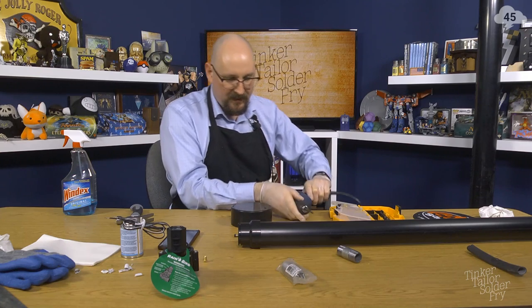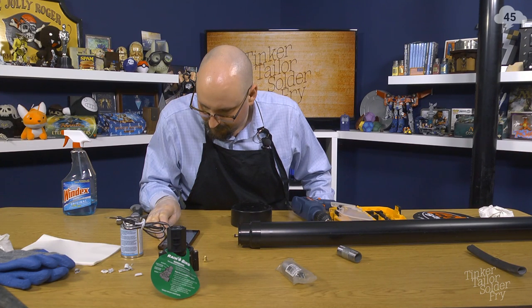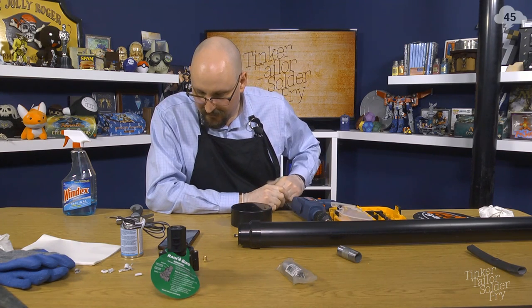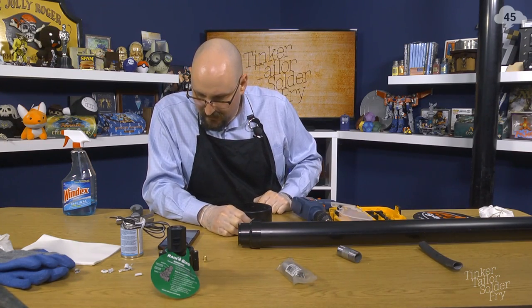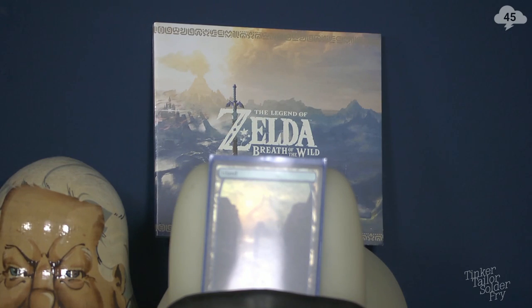The cap is going to be welded onto the end of the pressure vessel as well. If the welding fails, that's the part that'll blow. Let me double-check what they suggest. Install the Presta valve in the tank — drill a hole just smaller than the Presta valve. We couldn't use the full stem because the valve stem was already broken. Screw the Presta valve in so it sticks out inside, then seal the end.